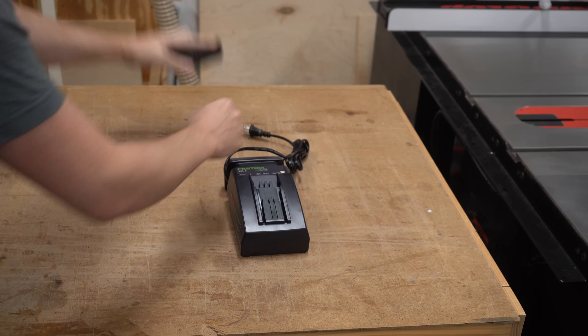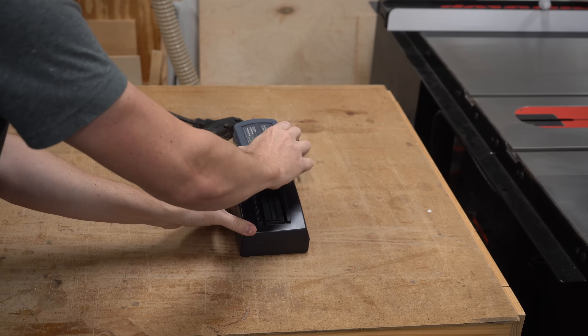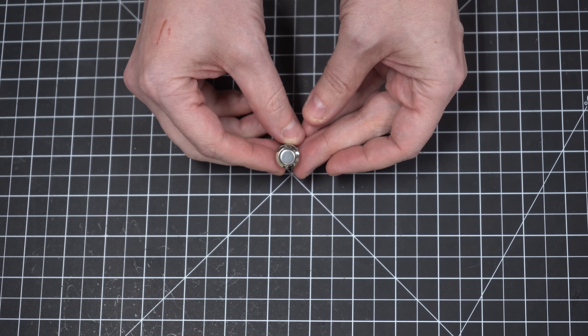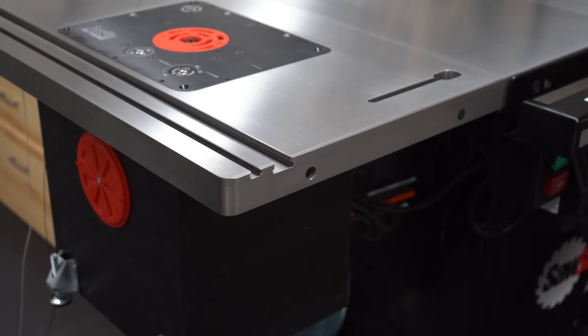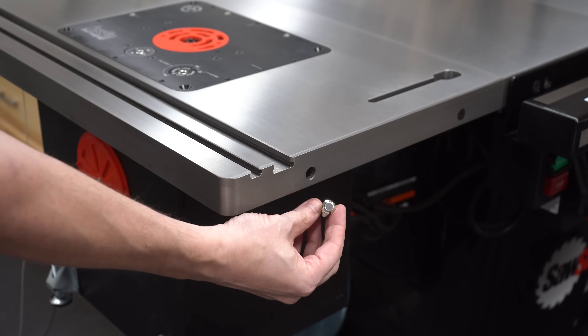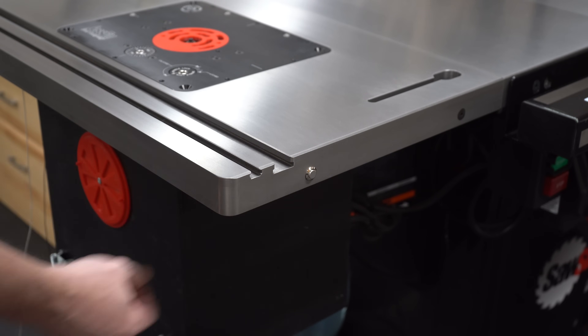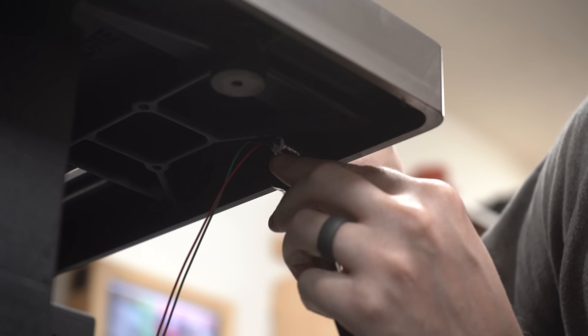For the tools we don't have monitored — because I plug multiple different things into the overhead power reel and don't want it kicking on the dust collection when I'm charging a battery or plugging in my grinder — we will use buttons to activate the benchtop dust collection. I'll do the same thing with the floor sweep. In trying to find a convenient location for them, I discovered that on my router table there are four holes on the side designed for mounting to the main table saw rail. These buttons fit in there perfectly, look really nice, and are in a nice centralized location in the shop, allowing for easy access.